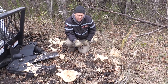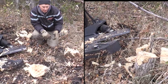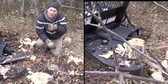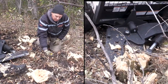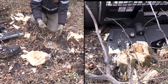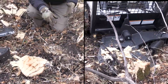So we just got done cutting another pair of trees — one tree with a diameter of about ten inches next to another tree that's about six inches. I came at it from a tough angle, but we did get it clipped off. You can see that even though I didn't cut through the whole stump in one shot, that's how you cut a larger tree — you can snip at it where you cut maybe half of the tree and then push in and cut again. So it is possible to cut trees larger than 12-inch diameter with this tree shear.